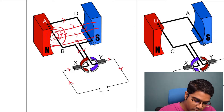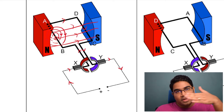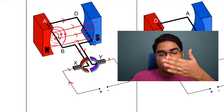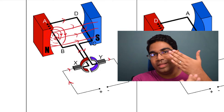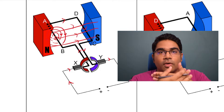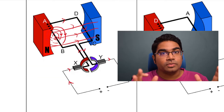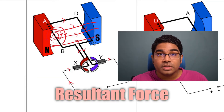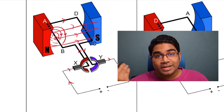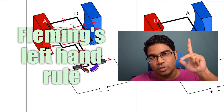From our point of view, the magnetic field around the coil will be clockwise. And the magnetic field from the permanent magnets. So now the two magnetic fields are going to interact. When they interact, they are going to form a catapult field. This catapult field is then going to form a resultant force. There will be a resultant force due to the catapult field. And how do we figure the direction of the resultant force? We use Fleming's left-hand rule.